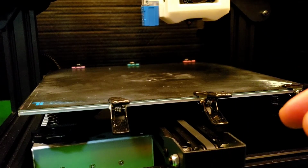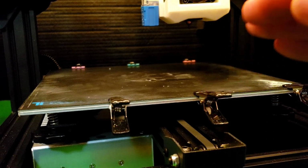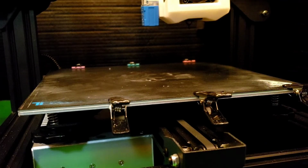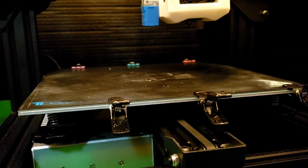It might work better with like a 0.4 nozzle, little smaller lines going out, you know, better resolution instead of the 0.6 kind of really taking that turn. So we'll see how it works. We're almost up to temp. I got like 4 degrees left to go on the bed, and we're going to start printing. And I got a skirt going, so that gave me some room to adjust the new offset up here.